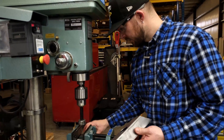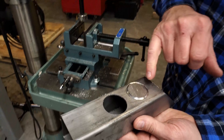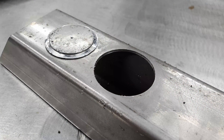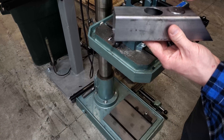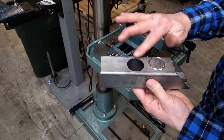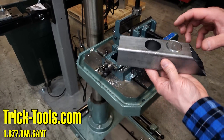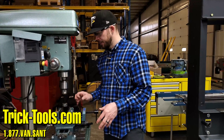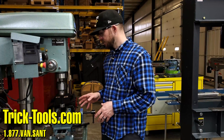This is the slug I just pulled out. You can see it's an outside cut — it cuts all the way around that outside edge and leaves a little bit of extra material on the slug as it's cutting, as long as you're lined up properly. You can see how nice, crisp, and clean that hole is. You can check out these Roto Cut cutters on our website at tricktools.com. If you have any more questions, give us a call and we can get those answered. Thanks for watching and we'll see you in the next one.